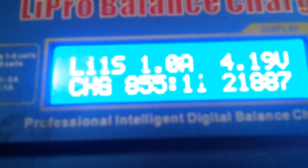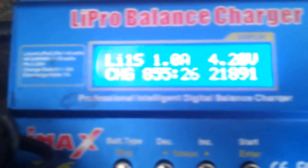That's been on all night — most of them were about two and a half volts. So I've got three lots on the go at the moment. This one would be considered a dumb charger, which is useful because this smart charger won't play ball when you've got a load of batteries that are only two volts. So we've got 20 in there on the dumb charger at about 3.7, about 15 or 20 in here on the smart charger at 4.2, and another 15 or 20 in this one at 3.7.